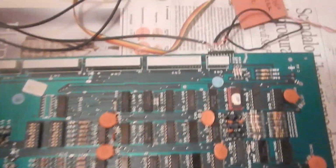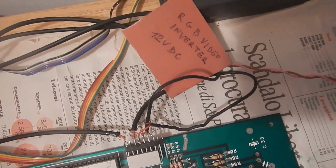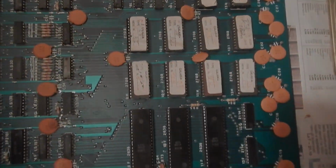So I'm ready for the first power on. As I said, for details about the power supply and video connections, check the other videos linked in the description. All we have is a white screen with 2 grey bars right below the center. Having now a bit of experience with these Zaccaria boards, I can tell that the CPU is not executing any of the initialization code, if anything at all.